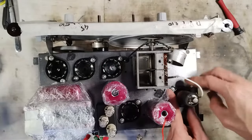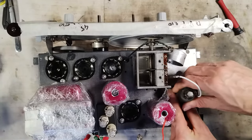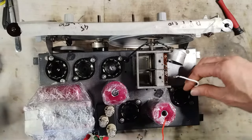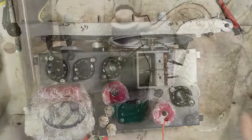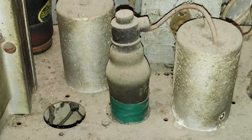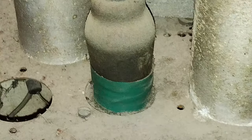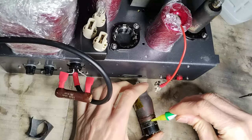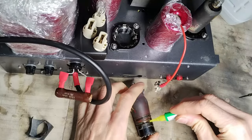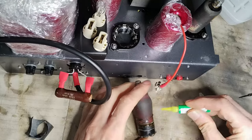These tubes are inserted and extracted, tilting their body. Therefore, the glass bulb must be firmly attached to their base, otherwise this operation would break them. Hence the reason for often finding them taped to their base. In this radio, the IF amplifier is one of those taped tubes requiring some super glue to fix the base properly.